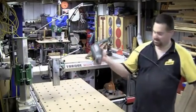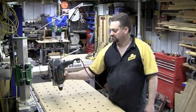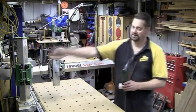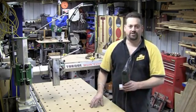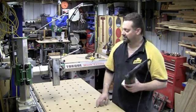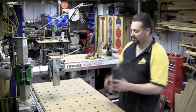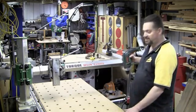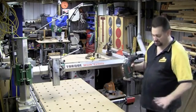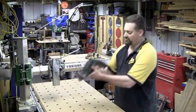You can also mount your drill, which turns it into a large drill press — a drill press with 900 or even 1300mm of range from the pillar. Most drill presses just do not have that sort of distance from the upright, so you're quite limited in how large a piece you can work before having to revert to a handheld drill. This will give you a drill right out to the edge of the table. You can swing it right round to the other side and actually drill into pieces that are on the ground. And with all those degrees of freedom, you can set the drill at any angle for plunging.